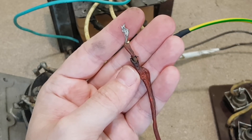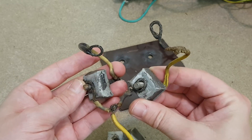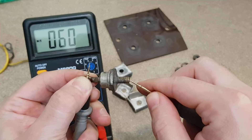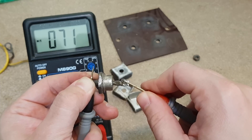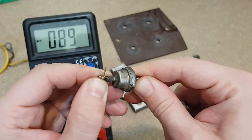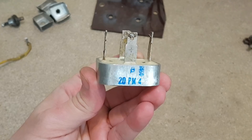Look at this wire — what manner of terrible things happened here? These connections are rubbish. I'm guessing somebody shorted the output by mistake, so the high-resistance wires and connections melted. But what about the diodes? This one is fine. Something is wrong here — this diode is conducting in both ways. Houston, we've had a problem. This diode is busted. I don't think it will help my cause — I'm referring to me receiving my father-in-law's blessing.